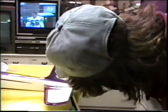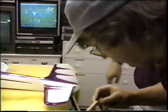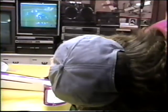Okay, get a little piece. You want the grain going front to back now. Otherwise, you're going to have all end grain up there. No, that's fine. And cut it oversized. We'll trim it to fit. Yeah, that'd be all right.